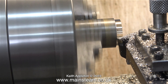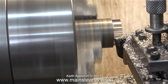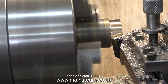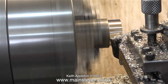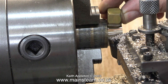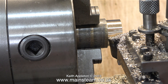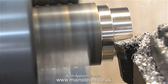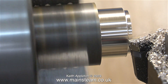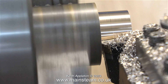The job begins by facing across the front of the piece of leaded bronze, followed by turning it longitudinally. This is a quite wasteful procedure — a lot of metal is going in the chip tray. I suppose I could have fabricated these fittings, but I'm going to make two of them from this one lump of phosphor bronze. I'm reducing the diameter to nine-sixteenths of an inch, which I will thread to take this nut. So that viewers don't slip into a coma, I've increased the speed of the video — this is running at 400%, four times normal speed.